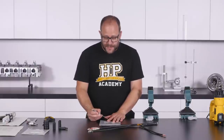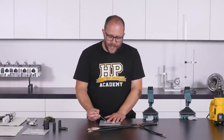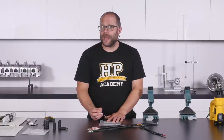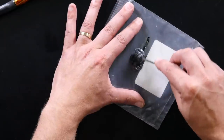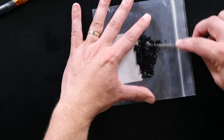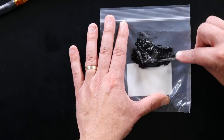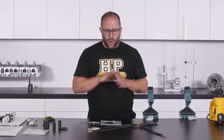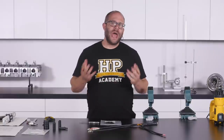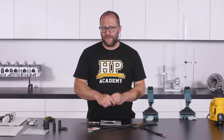Using a pick, simply mix the compound much like you would any other epoxy. It should be completely black in appearance when mixing is complete — make sure there are no grey streaks through it whatsoever. The working time on these epoxies is typically around an hour, though it may vary with different brands and the temperature you're working under. They fully cure typically after about 24 hours.